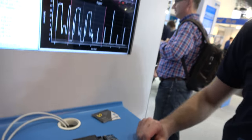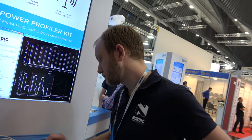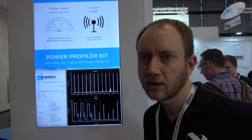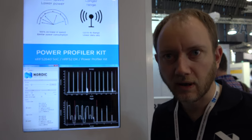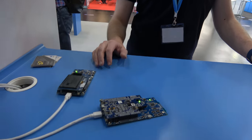This is running on the new NRF52840, enabling the best of Bluetooth 5. We have full support for high speed and long range, and we also have hardware support for advertising extensions even though we don't have the software for that yet. And that's an ARM Cortex M4F, running at 64 MHz.